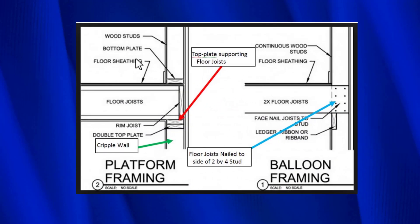This detail shows the difference between platform framing, which is mostly what we see in the San Francisco Bay Area. With platform framing, you have the upper top plate and the lower top plate. The plywood would come up and nail into the upper top plate, and then we'd put an L90 or some kind of steel there to complete our retrofit. This is what we normally see.